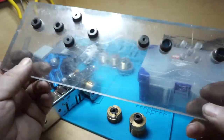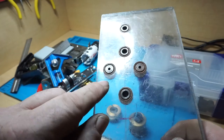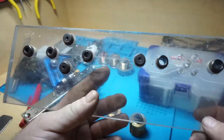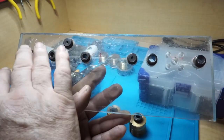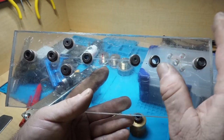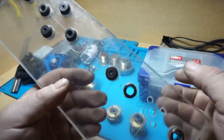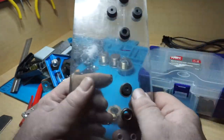This particular one has a specific purpose. These inserts are pressed in with a vise, and I have different sizes of holes — some eighth-inch, some quarter-inch, another eighth-inch, and I think these are three-eighths. This is a jig for the installation of a certain type of electronic lock. It has a lot of components and makes for easy setup and installation when you're installing lots of a particular model. I'm holding off showing that video until I'm installing many of them, and I'll show how it all comes together for a newer model lock I'm installing. I've been using the paper template for about two or three years, and I want to make one of these because it makes it three times quicker.